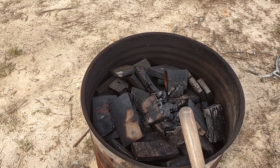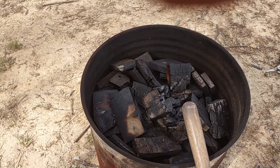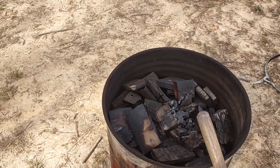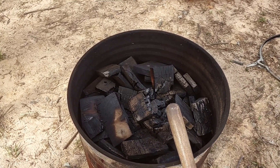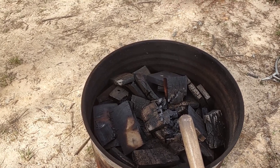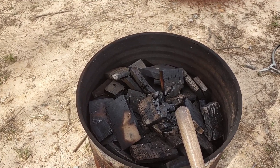A couple of times it was just smoking and never came back to a flame. I've got a small handheld map gas torch — I'd poke that in there and within about two seconds it went from total smoke to a clear flame. That may be really useful if you've got a smaller setup and it's struggling to get back to a clean burn — just try the torch to kick it over the threshold.